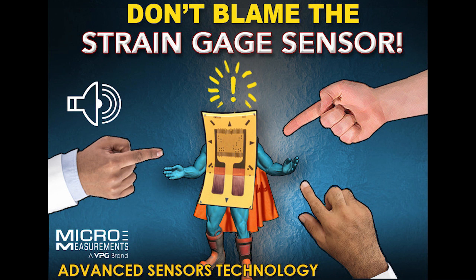Number three: look at the wiring connections to the instrument. On a pretty regular basis we find that customers will either miswire a strain gauge into their electronics, or — since we now use a lot of RJ45-style connections with our data acquisition systems — sometimes they will miswire it. It's an easy mistake to make. So rather than go and scrape your strain gauge off, take a few minutes and troubleshoot the pinouts on your connections that feed into your instrument.